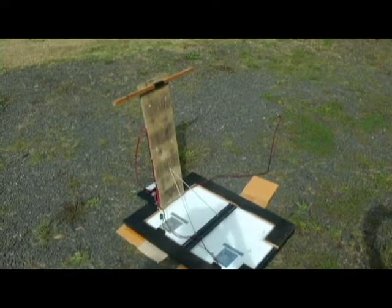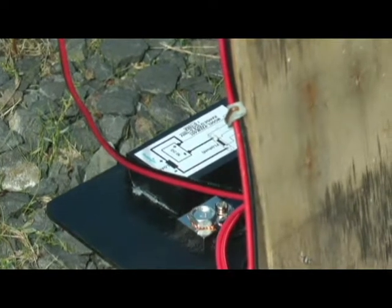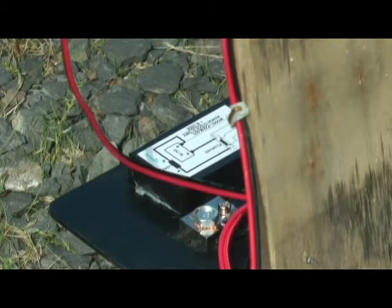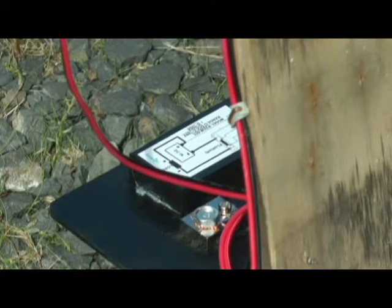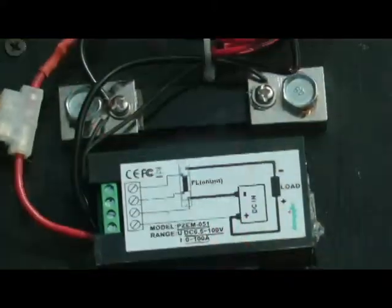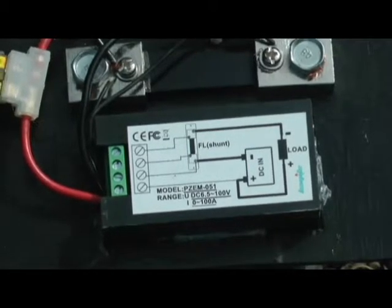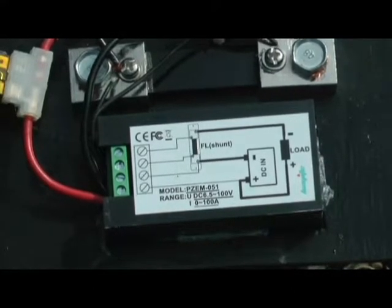The only thing that was at all confusing is there's a diagram on the back of the meter, and it's just the way it's labeled. It's labeled for conventional use. Go around the other side so you can see it better, but what looks like a schematic showing a battery is actually the solar panels in this configuration. And what is the load in this diagram is actually the battery — the bicycle battery. You might have to just draw it up so it makes more sense to you. Again, what they show as a battery is actually the panels, and what they show as the load is actually the battery in this situation. And it's applied with a shunt — you have to wire that just as it shows there.